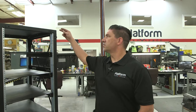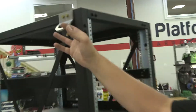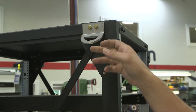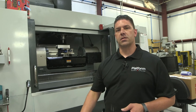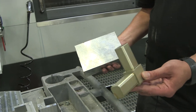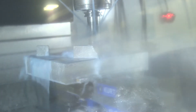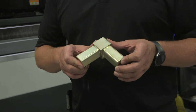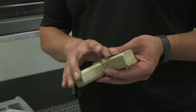Next step is we cut out our corners on our 5-axis Haas CNC machine, then cut out the tie-downs on our water jet, and bend them on our Primeline CNC press brake. Here at our Haas CNC machine, we take a hunk of metal and turn it into one of our corners for our racks. We do all of our machining in-house, all of our QA and precision measurements right here on site. It's considerably better to make your parts out of one piece if you can — you eliminate welds, eliminate cracks in welds, you don't have to rivet pieces together, and it's also considerably stronger.